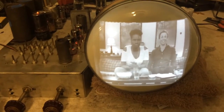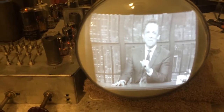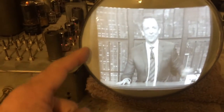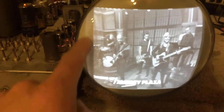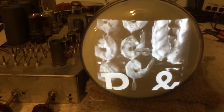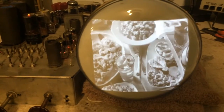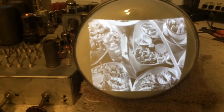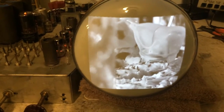Perfect — almost a perfect picture. The picture is really good for a little tiny electrostatic set. I do have some 60 hertz running from bottom to top, some interference. I believe that is my Agile modulator doing that. My modulator has started humming recently, and I noticed it on multiple sets when I use my modulator, so I think I have to recap my modulator.